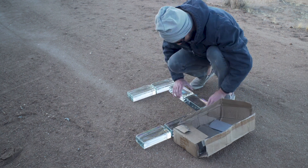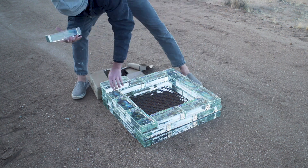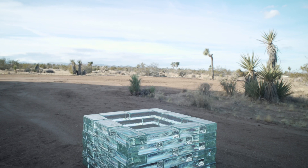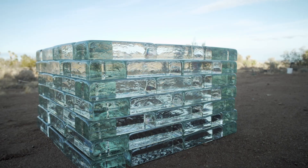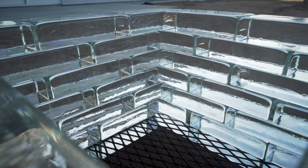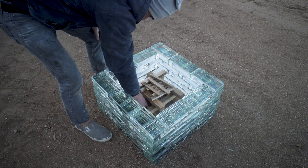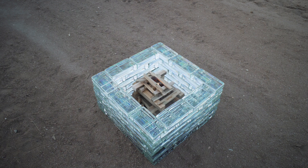For the first test fire pit I really want to push the envelope with a small, high-walled fire pit that will have a lot of heat right up against the glass. I put a piece of steel mesh one row of bricks up so the flames would be more centered within the pit. I'm not using any mortar or epoxies — for these early experiments I just want to see how they respond to the intended environment before committing to a more permanent project. I try to rush through and get a small simple set of projects done because I find I learn faster this way than just researching alone. I often do this before even sketching aesthetics or dimensions, because these early tests will impact the geometry I end up choosing.